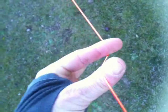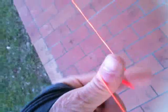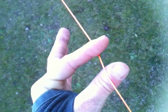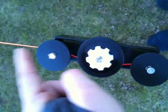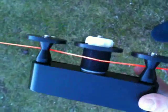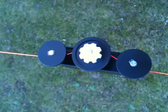Line tension, we divide it in three. Line is pretty tight. Line is average tight. And line is loose, very loose. So there are different techniques for each of these lines. Tight line will be adequate tension for running the FAST. You're going to have to run the line into the shortest distance between the spool. The line will be running under the center part when you pick up the unit. The average line will be not so tight, but not loose, and you can pretty much get a 90-degree turn on that line when you test it with your fingers.